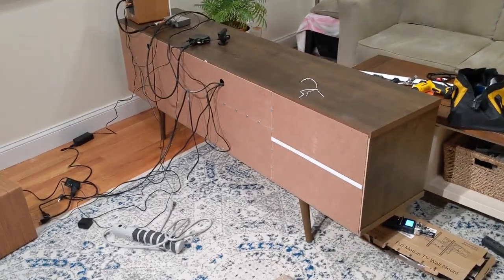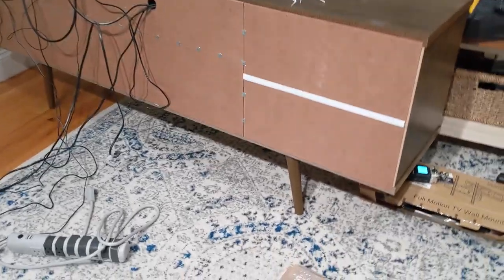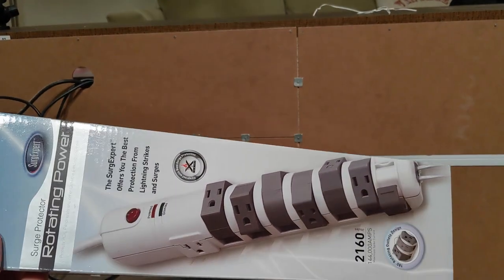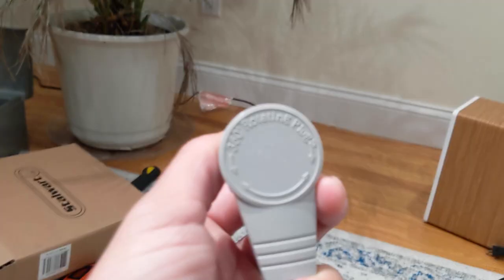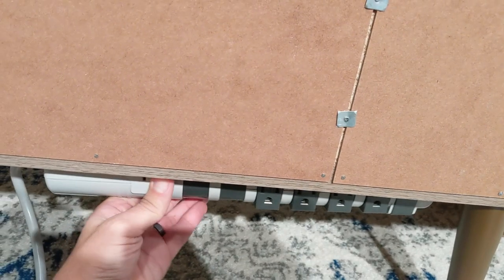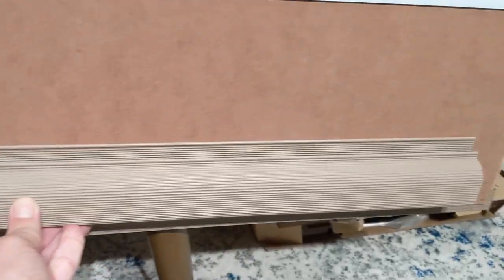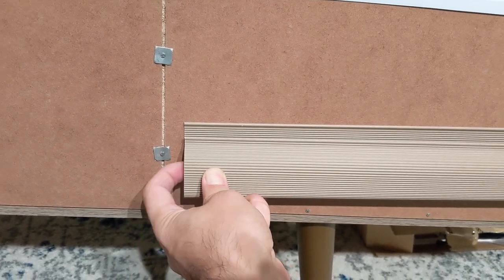TV's up, but the TV stand stands out. If you remember, when the TV stand was there we had a bunch of cabling issues — wiring visible underneath since it's that fancy mid-century modern on little legs. My solution is twofold. First, the power strip: you can turn the power outlets to your liking, and the wall plug is flat and rotates so it doesn't jut out from the wall. To mount it underneath, maybe an inch or two in from the edge so all the power bricks and stuff have space to breathe, running cables up from there. And to make sure these cables don't reach the floor, we have these J channels. Don't put them right flush next to each other — give it maybe two inches in between so you can get the cables up and into the J channels.